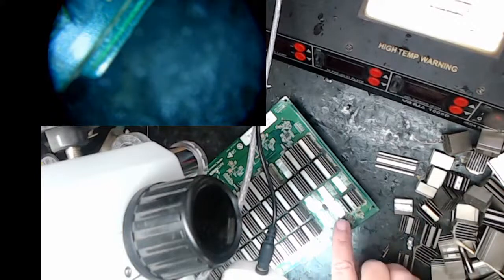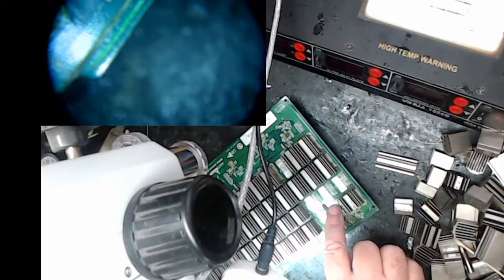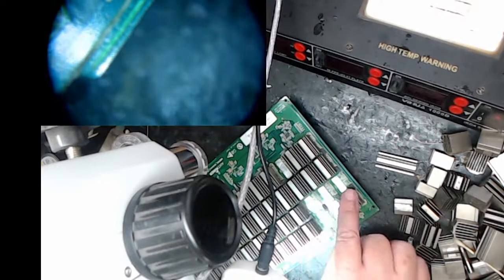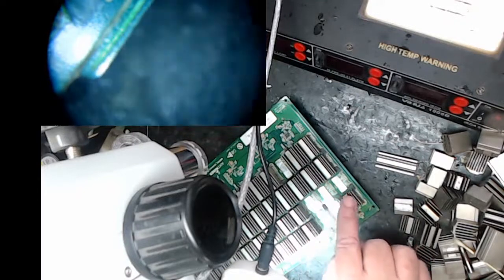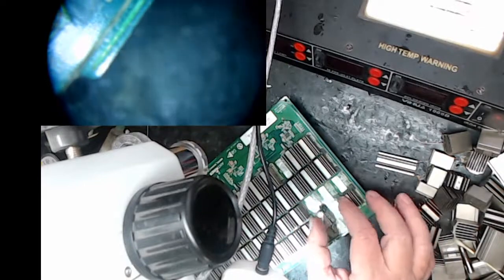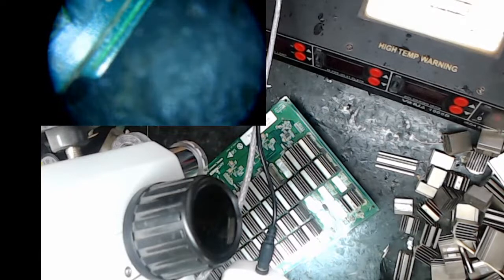So if we were doing this chip that was on the other side, the back of the board, I would usually try to have all around heat sinks, and I sit it on there, and it gets hot enough between all these heat sinks because there are, I think, plates of copper running through it. It's just really a heavy board. So on the S17, I can't set the chip using the heat sink on the back, because the heat sink's cooling it off too badly and there's too much metal in there dissipating the heat. So it kind of depends on your board.